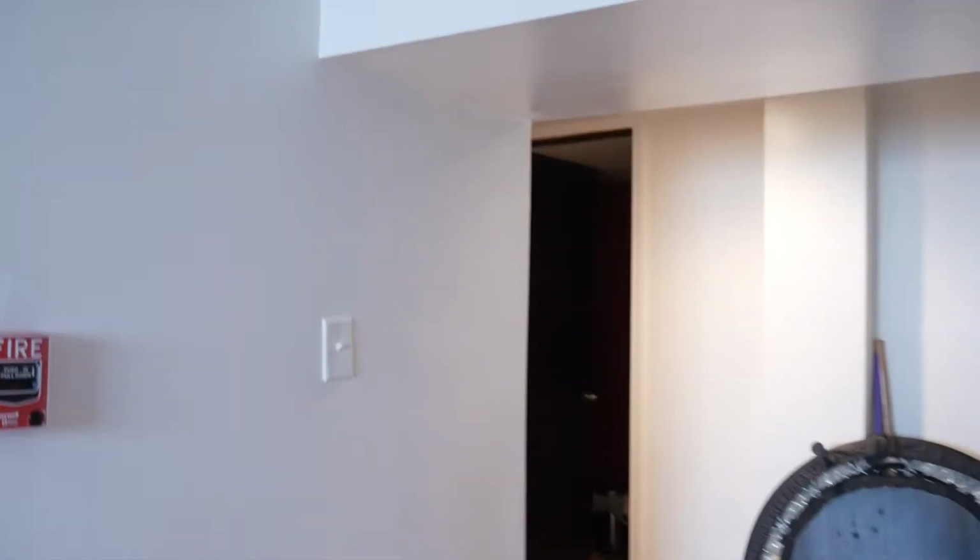So what a beam detector is, basically, it's a smoke detector. It detects smoke obviously, but spot detectors like these are meant for small spaces, kind of like this, because it's a small space. But beam detectors are meant for large warehouses, large buildings, museums, where spot type detectors won't do. They're not sensitive enough, or like how can I put that? It's too large of an area, where spot type detectors would be too expensive, or it'd take too many spot type detectors to put in a large space. Sorry that this isn't a good explanation, but beam detectors are meant for large areas that need protecting.